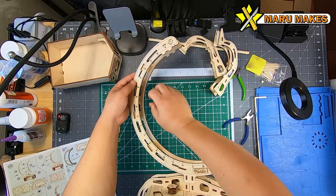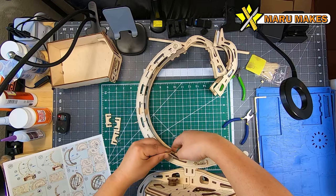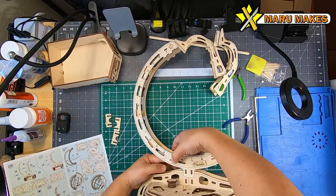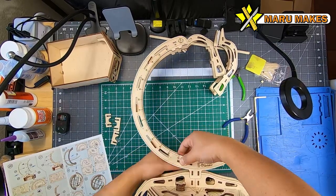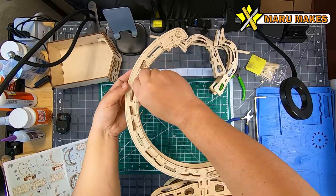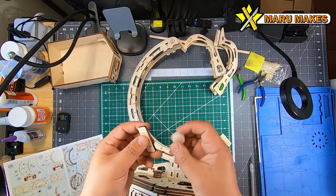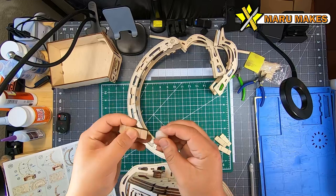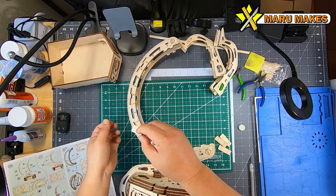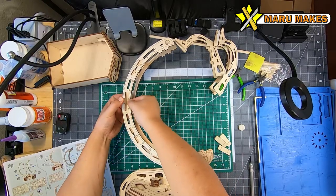So to understand how this globe axis is being held into place, you're putting one piece that's going to be wedged on the bottom side, and then you're going to slide through the second piece, and then you're going to take that piece and push it up so that it's locked in on the top, and then the first piece is locked on the bottom. And then you're going to get a wedge piece that's like a sliver wood piece, and you're going to fit it through the two pieces so that it compresses everything, and so that nothing would budge. So what you need to do is put the wax on it, because if you don't put the wax on this wedge piece, it's really hard to fit through because it's a very tight squeeze. The wax reduces the friction so that it's a lot easier to slide that piece in between and hold everything in place.